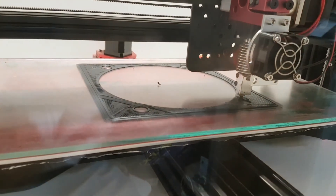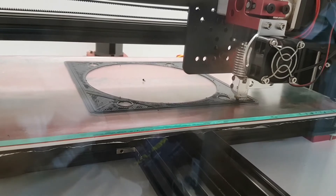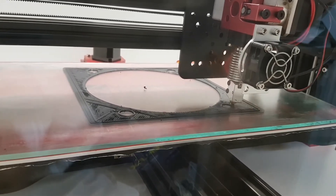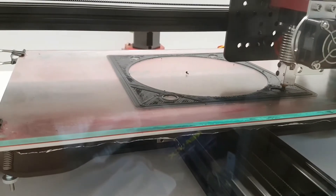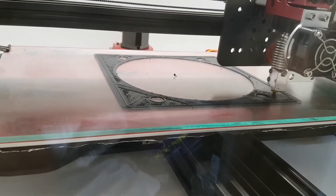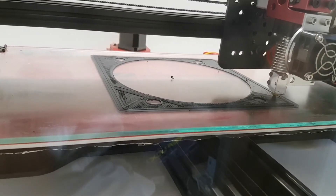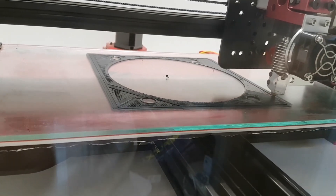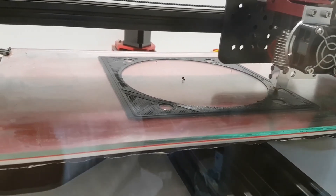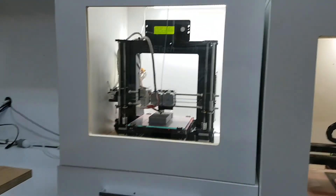This here is a 0.8 millimeter tip, and it's already on the second layer — in the short time I've been taking this video it's really thumping through the material. The 15 cubic millimeters a second is getting the job done; I'm quite impressed with the throughput. I'm just a bit frightened that around 10 millimeters of height it may have pulled away from the bed — that's the big experiment here. If I can't get ABS to behave at this size and density I'll have to switch back to PLA, but I do like how ABS behaves generally, except for that shrinkage. Feel free to like, share, subscribe, ask a question, leave a comment — bye for now.